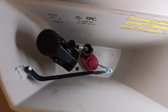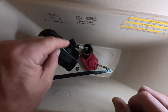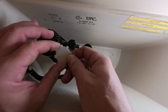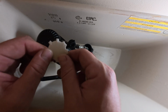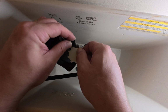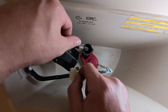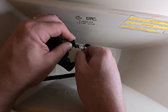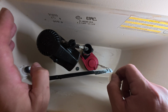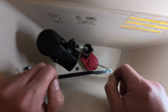That water adjustment I was showing you earlier is right here on the top, so you can change your flow by how much water you want to enter in or to slow down that flow. And they give you this adjustment key, and I'll show you that real quick while we're here. So they've got 1, 2, 3, all the way to 8, I believe. The way that works, you're supposed to turn this all the way open, and then you tighten down or close it until that adjustment key shows the number of adjustments you're wanting. So if I was wanting adjustment 1, open it all the way up, close it down, and then that would be adjustment 1, and then you would rotate this key, so on and so forth. And again, that's very specific to this valve. Not all valves have that adjustability, but this one does, so we're going to work with that here in just a minute.